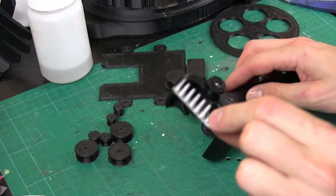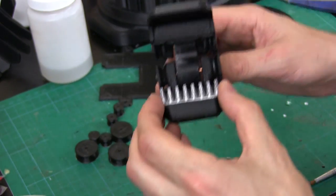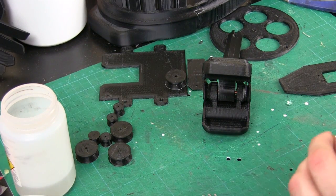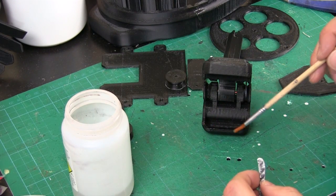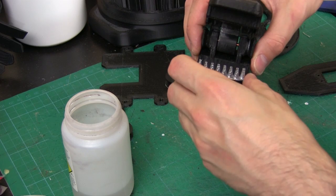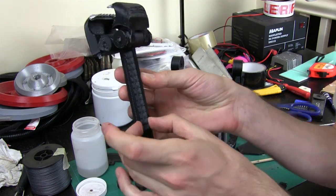I've painted up my tiny teeth using an extremely cheap one-pound chrome spray paint, and I'm going to get some acetone on a small brush and mount those on the inside of the jaw at the top and the bottom — it's looking like it's taking shape quite nicely. I've got some acetone here which will melt ABS, and also a pot which has ABS dissolved in acetone making an ABS glue or paste. These parts are fairly flat so I'm just going to use plain acetone — I'll wet along there and the bottom of the teeth and stick the bottom and top jaw pieces on. Be careful because the acetone will take the silver paint off as well, and you should do this in a well-ventilated area. That should make a chemical weld and stick it on pretty permanently. I've got my teeth stuck on there which works quite well, and I've got these knobbly bits that need to be stuck to the shaft in the same way.